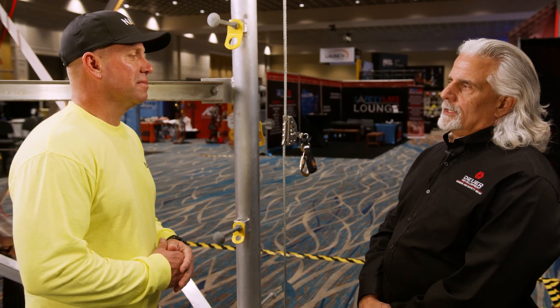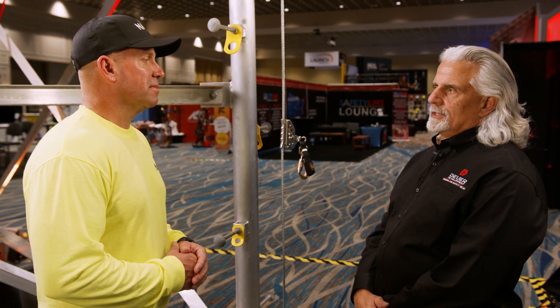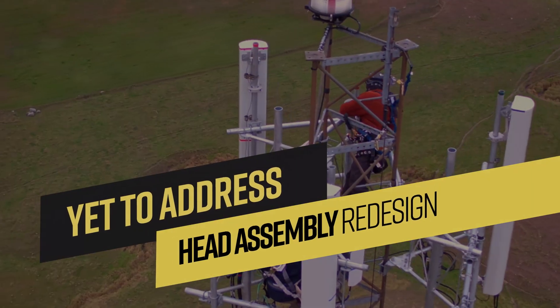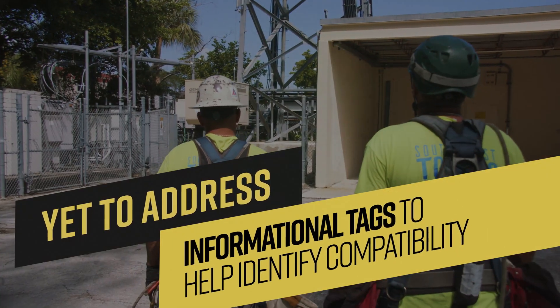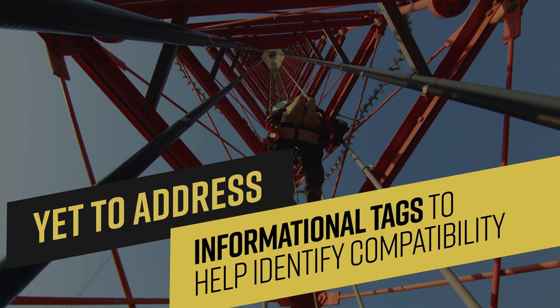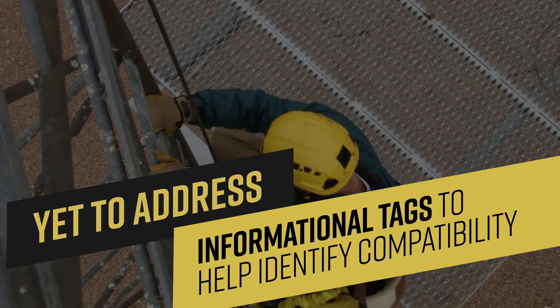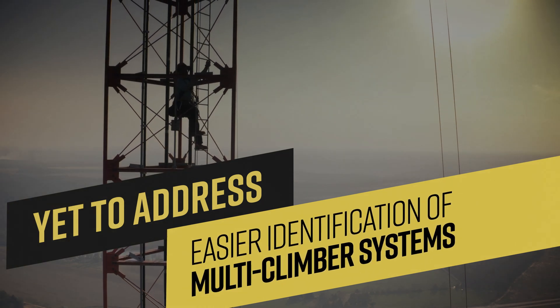Time to look into the crystal ball — what lies ahead for the safety climb system? We're going to take the information that we gathered and present it to the American National Standards Institute for fall protection safety and incorporate a number of these items into the next safety standard for fall protection. On these systems, we need to address a redesign on the head assembly and tagging or IDs at the bottom of the structure, which will call out the size, type, and construction of the wire rope for compatibility with the safety sleeve, and additional information for multiple climbers on the system at the same time.